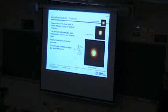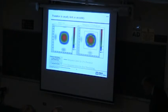You just threshold it. You just set a threshold, 10 or 12% typically. And then you look at primarily just the center region, and use a very conventional centroiding algorithm. The key though is that threshold. Make sure that you apply some kind of threshold, and the results depend strongly on the threshold. Here's an example of a couple different thresholds that I'm showing here. This threshold here is a 12% threshold. We just found the brightest pixel, and then we set the threshold at 12% of that. And those are the spots you keep here.